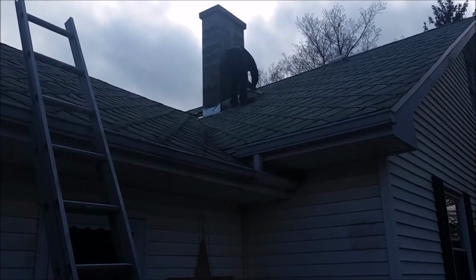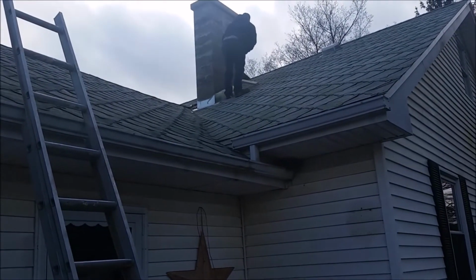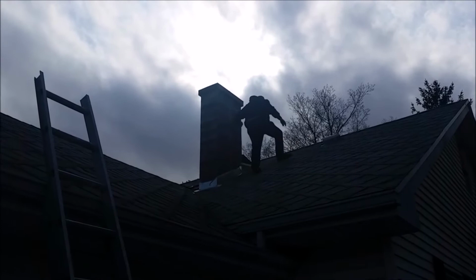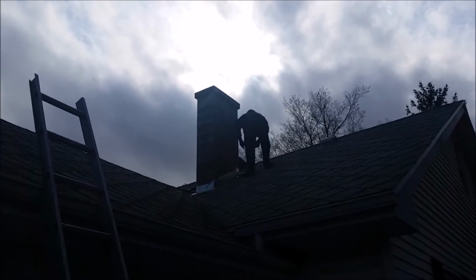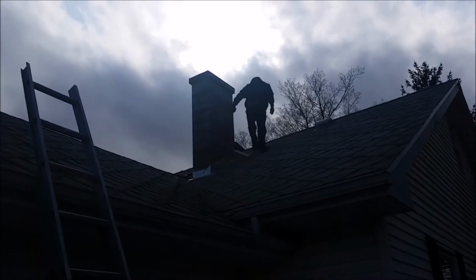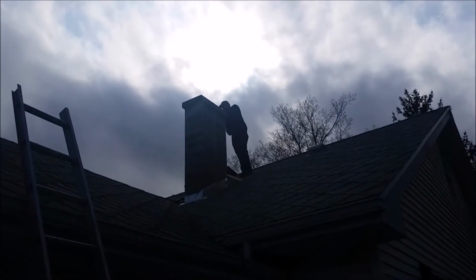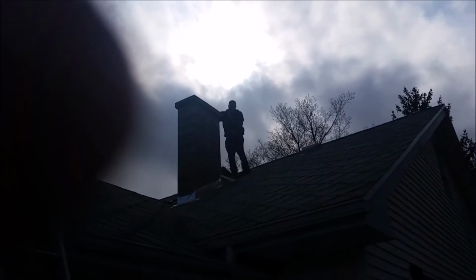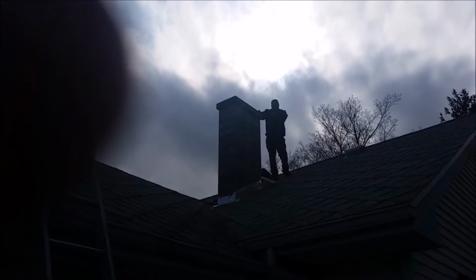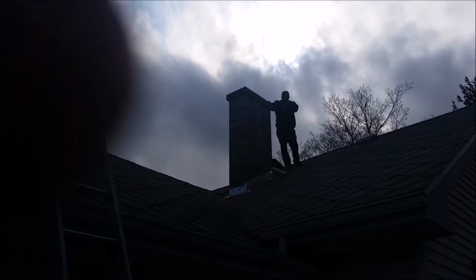On a flat roof it's just a straight line all the way across, like what we did on the chimney repair last year. He's trying to use his 2x4 to keep that up against in contact with the cement while it's drying. What kind of a setup time does that stuff have? Pretty fast, it's already doing it. So that'll be the first layer, and this will just protect and keep that. It's kind of going to stick that flashing to the concrete. So when I put my top apron in the groove, and maybe even mortar that in or caulk it, I don't know. Fold it over.